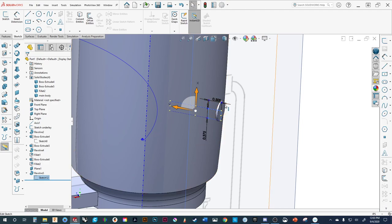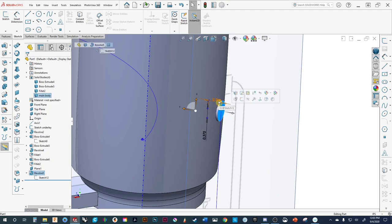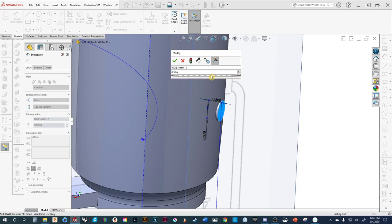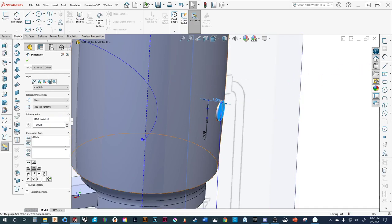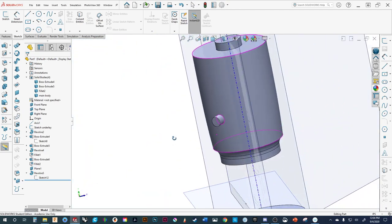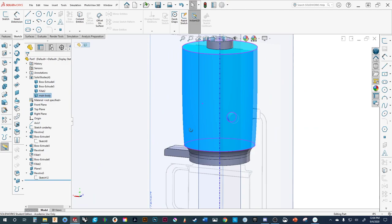Let me show you this — I made a mistake in my sketch. I'm going to select that face and pull out the surface. But because it's defined, it won't let me. So let's go in and drag the dimension that way. We'll say one inch, and that's what we want. You can also see it's the main body and all one piece. Now we want that over on the other side, but we don't want to have to redraw it.